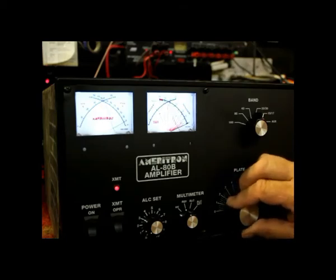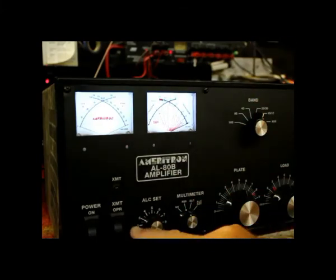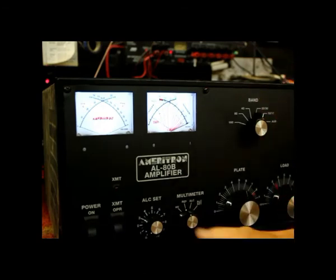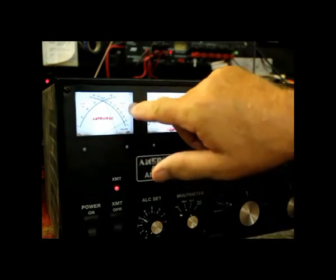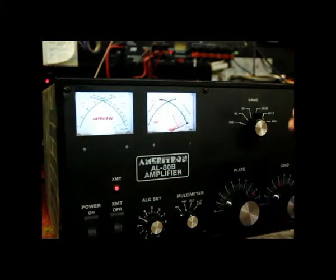I'm trying to go right at 200 milliamps of peak grid current with this drive power. Now if I hosed up the loading and had too much loading, you see the red light starts to come on and there I made it trip out. So if I try to reset it, it just goes right back off. When it does that, you just open the load control up a little bit and then you turn it on and it's back in operation. As I peak the plate, the grid current peaks and the output power peaks. Then I go up and open the loading control a little bit more until it falls off. The red light goes away — it's at 200 milliamps of peak grid current. It's really pretty fast.